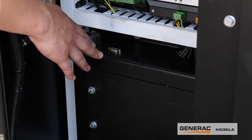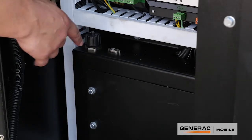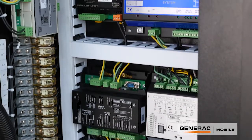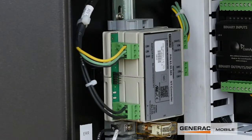You also have an IG AVRI and an IG AVRI transformer for voltage sensing behind there. That's segregated to get rid of high-voltage and low-voltage concerns. This component takes in the CAN signal for load sharing and outputs that analog signal for third-party controller paralleling and load sharing.